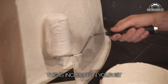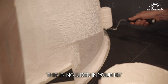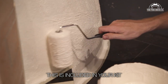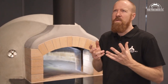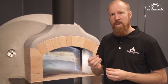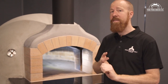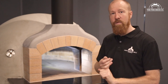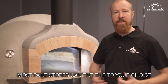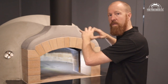Roll-on render — here in Australia we call it acrylic roll-on render. It's a water-based material designed for rolling onto the side of houses. It's a very commonly used material, sort of like a thick paint with a grit through it to give it a texture. The beauty of the roll-on render: firstly, it gives you a color. You can get it in a whole range of different colors, so you can pick a color that's right for you and get a nice uniform color over the whole dome.